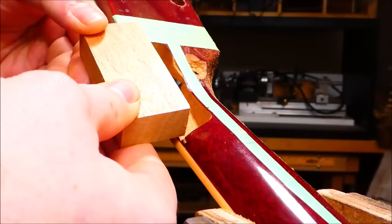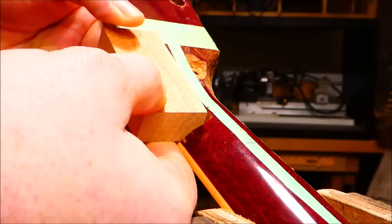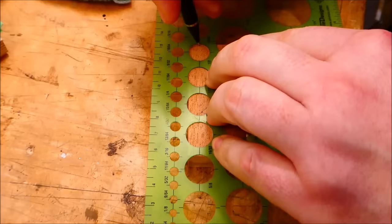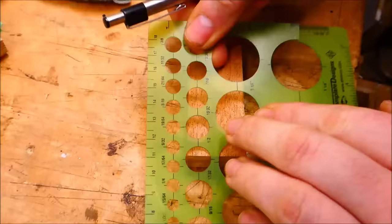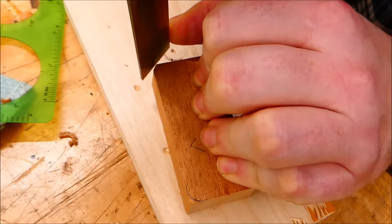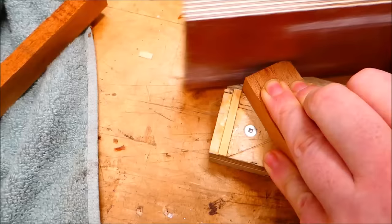Here's what's left — I routed right through the truss rod pocket, as you can see. I can't route both sides at this time or it would totally fall apart, so I go about plugging side one. I make a nice snug plug and then use a circle template to mark the quarter rounds on each side. This is a loose guideline — I could come up with a jig, but it's fun to use a chisel and sneak up on the right fit and practice hand tool skills.